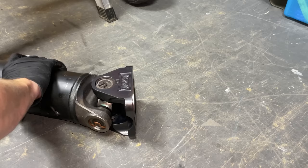So this here is the drive shaft safety loop. It goes around the outside of this, and in case this blows up or something, it stops it all flying out and getting the crowd. Got the front one there ready as well, look. Next, we need to get this thingamajig here and bolt it onto that. I suppose we better put a bit of grease on there, and a bit of Loctite. And then we've got to get another one onto the front here on the transfer case.